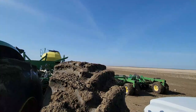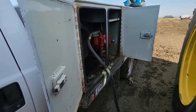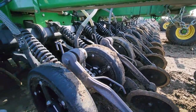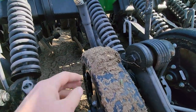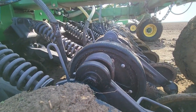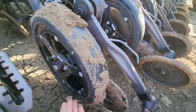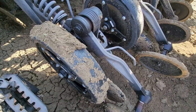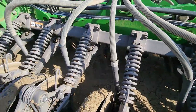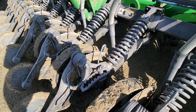Another morning and we're down here at the pivots again, but it's a little muddy still. We're trying to get the tractor fueled up and see if we can get any seed in the ground today. Something I was talking about in last week's video — keeping an eye on these discs when it gets muddy. You can see this area is relatively clean, but then we have a big mud clump up here. These mud clumps can actually affect seeding depth because this is our depth wheel, so if there's a big mud clot built up, our seed is going to end up a little bit shallower. We don't want seeds being super shallow, so usually as long as these aren't picking up mud I can seed in the rain, but once they start picking up mud, that's when I quit.